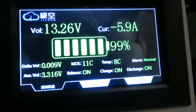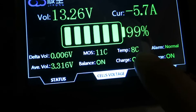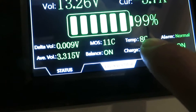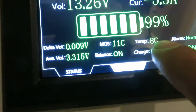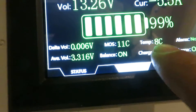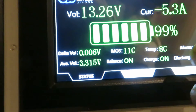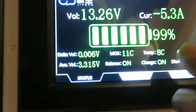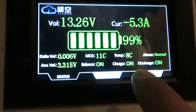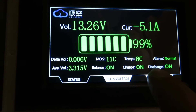There are two temperature sensors in the battery. The display shows the higher of the two — for example, if one sensor reads 8 degrees and the other reads 7.5 degrees, it displays 8 degrees. However, the actual heater control is based on the lower of the two, to make sure the battery will not be charged when the temperature is freezing or below whatever threshold you set.